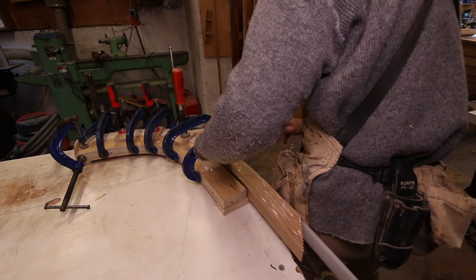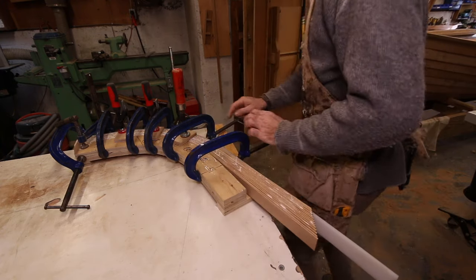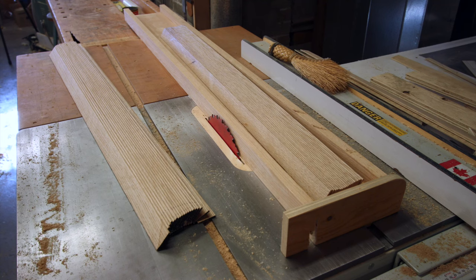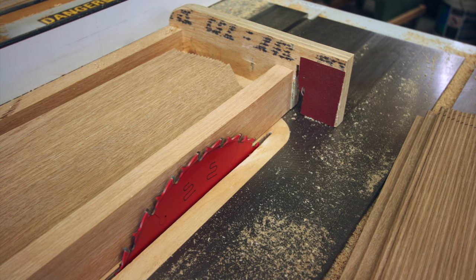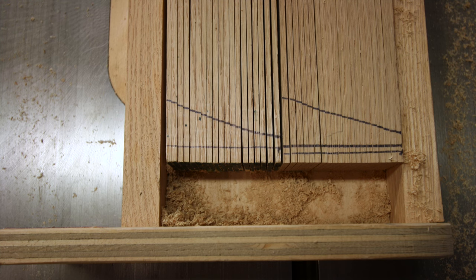To make our laminated knee we're going to need laminations, which we'll make out of white oak. I've got a table saw sled for making these — a simple setup with a nice tray to drop your finished laminations into. I don't need to adjust anything; the blade is set to give me a 1-1/8 inch wide lamination. The sled rides in the t-slot on the table, and an extension on the back carries the billet and pushes it all the way through. When I'm done I draw a justification mark on all parts to keep them oriented the same in the finished product. Then I square up the laminations by trimming the rough end off and we're ready to start gluing.